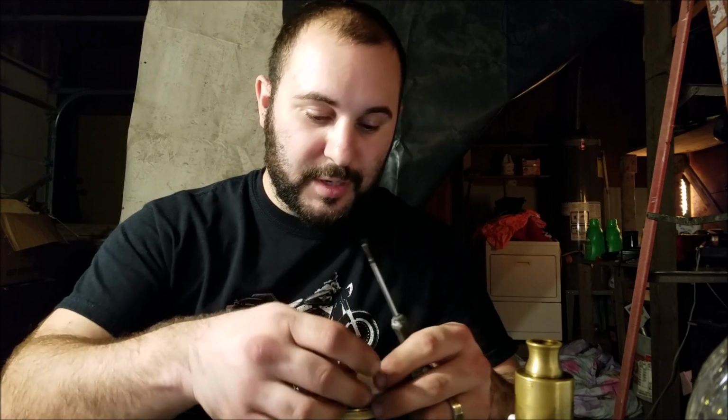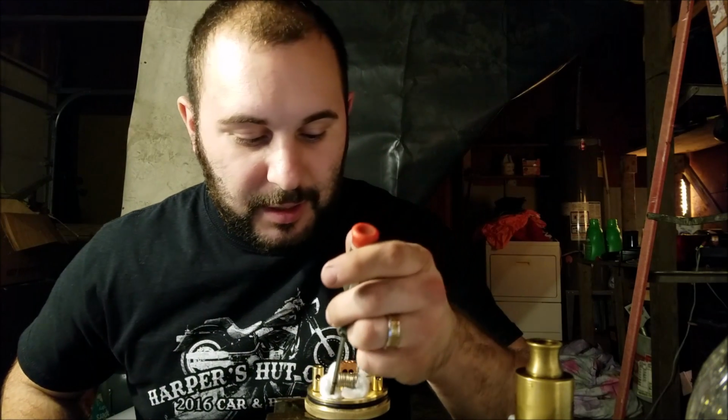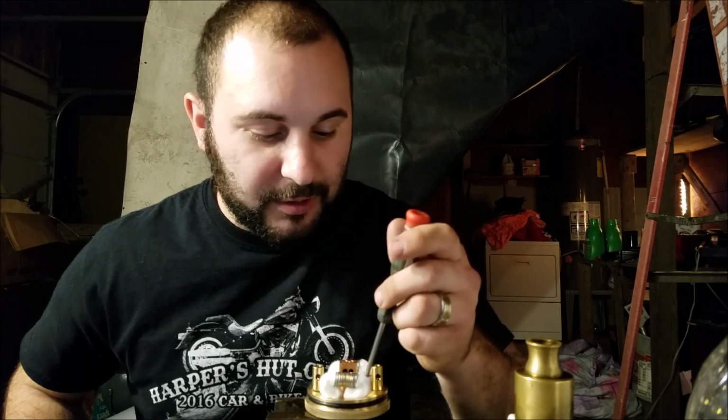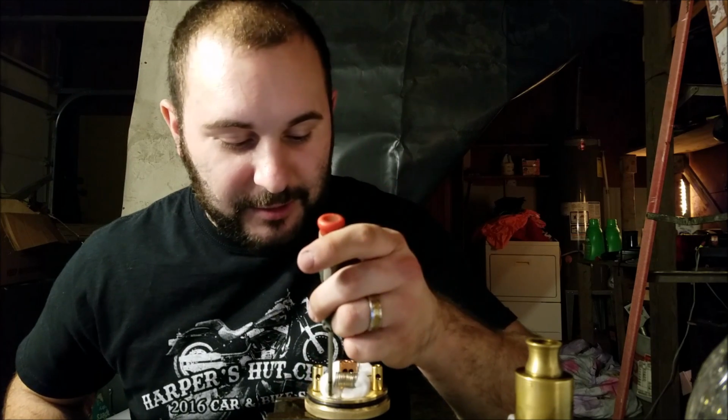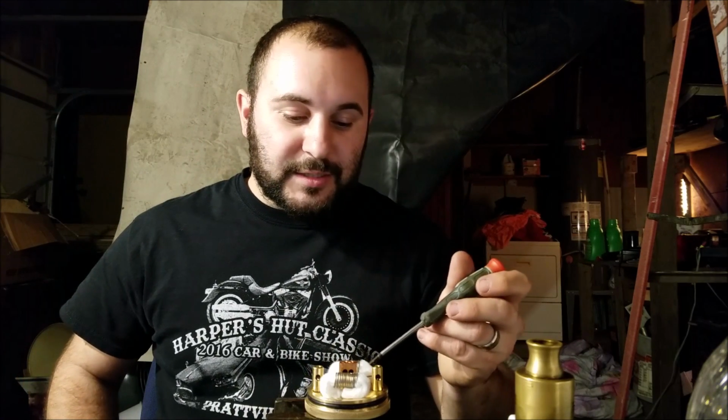Now when I get to work Monday morning, I realized that our motor tester, we've got a $35,000 surge tester, and it's made for testing electric motor windings. It's ridiculously accurate. I think it's got a 6,000 volt limit. The DC tests, it can check the mega ohms of resistance to ground. It can check the highest potential, up to 6,000 volts DC to test to ensure that you're well insulated.